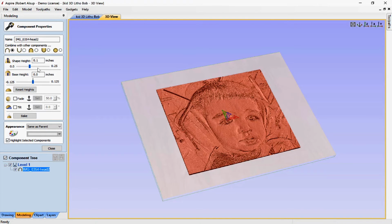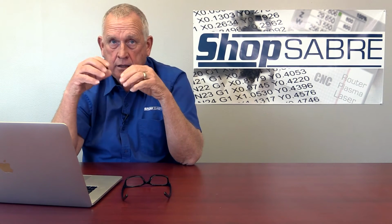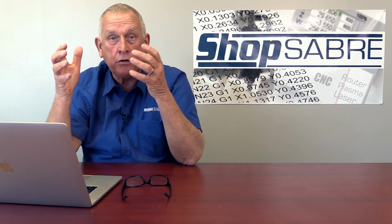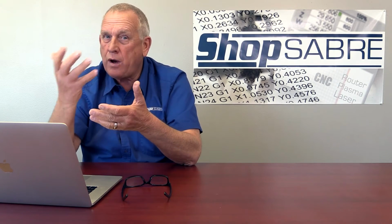And we've got a total height here. Let's slide this back and forth. You can see the benefit. Okay, see, that makes it higher. Now, if you notice also, this is reversed, and here's why. Think about how this works. We're going to have light behind it, okay? So parts of the photograph, for instance, eyebrows are going to be darker, then you know the thickness of the material has to be more in order to block some of the light. So that's why it's inverted.